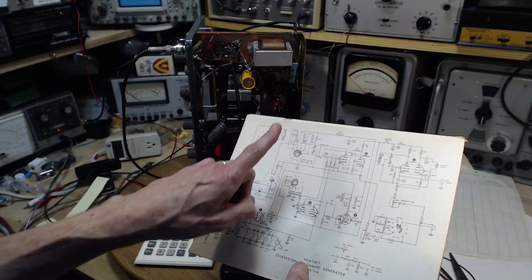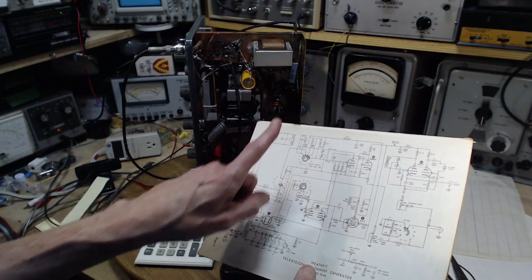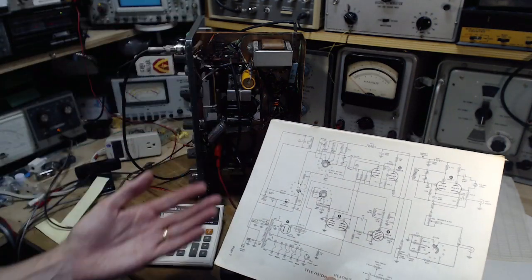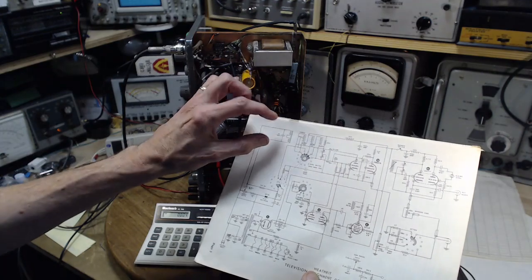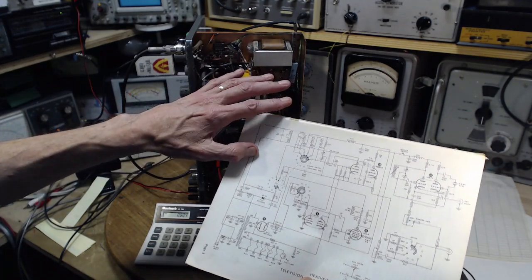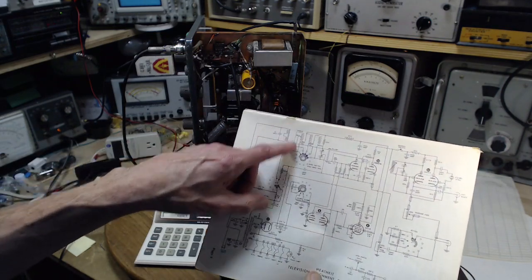So you always have DC going. You always have DC flowing through it, and you're just varying it at 60 cycles here. That variation then is carried over. I think if you let this go through a zero, if you didn't bias it and have a steady current going through it, you wouldn't get the effect you want. You'd start transforming, in fact.